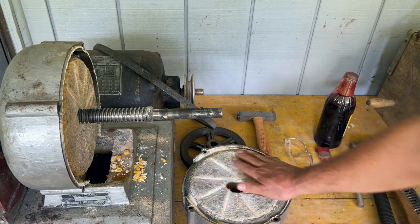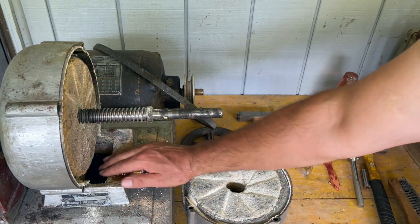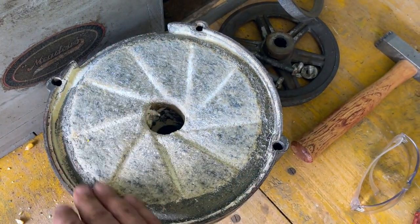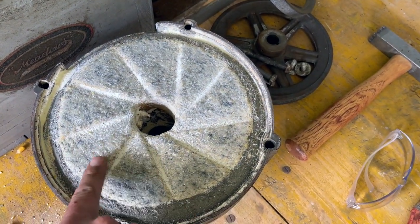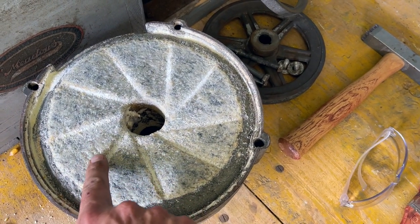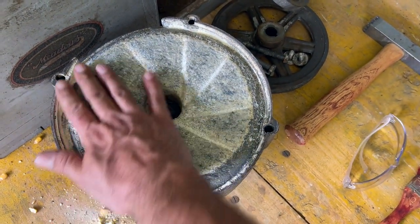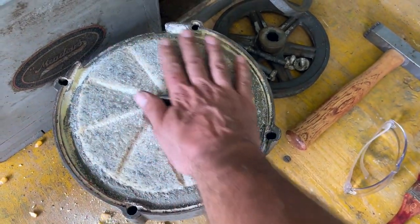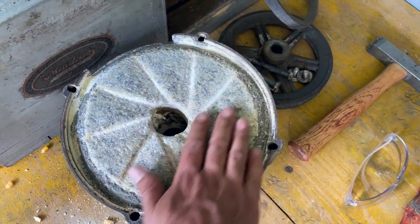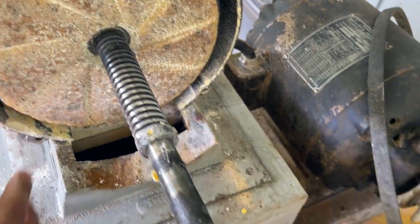There you can see the face of the stones. You might be able to see it in the video, but if you can tell how smooth and slick that is - especially right there, it's really smooth and slick. That's what I call tombstoned. When a millstone gets tombstoned, it gets real slick and polished. That's from just being used and never being dressed. And you can see the runner stone here - it's about the same way, it's really, really slick.